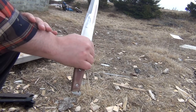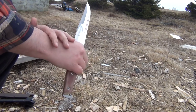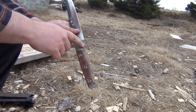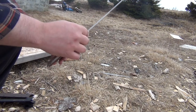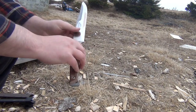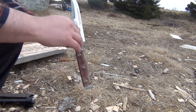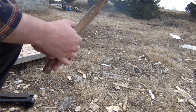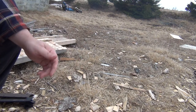This really isn't a functional grip. It gets cold here a lot, I don't like to wear gloves, so working up around the steel itself is not really functional. Plus, this is not really chamfered — the edges are just broken, and the spine is relatively squarish here. This is easy to fix. Some people like sharp spines for scraping off ferro rods and that type of deal. But if you wanted to round this up and chamfer it out, it's not a huge amount of work. Still, you're holding up on the steel, it's relatively thin, and when you put a lot of pressure into it, you can feel it as a high contact point.